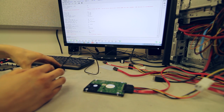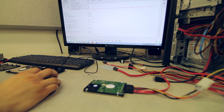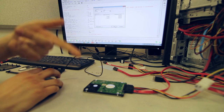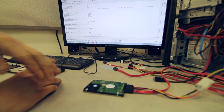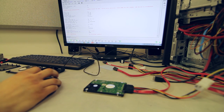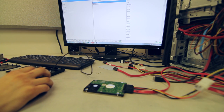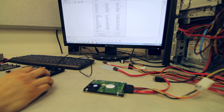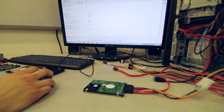So we somehow need to get access to the relo list module that is a part of the firmware. The way I'm going to get this done is to shift the region addresses in the firmware by one, and write it into the firmware of the drive. Now the drive is not getting into the proper positions where the regions begin. It's going to be pointed to a different spot, which automatically will send it to kernel mode. Power down. And as you can see, this time it lets us into the utility all by itself. It indicates that the regions have been moved over, which is fine.